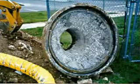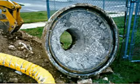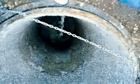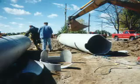In doing this, first remove the reducer section from the existing 48-inch deteriorated manhole. Clean the loose debris from the surface of the old manhole and make cutouts in the 42-inch fiberglass manhole liner.